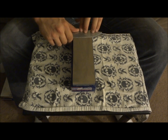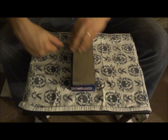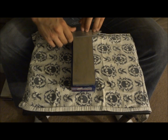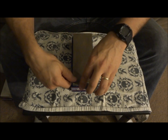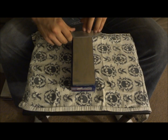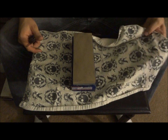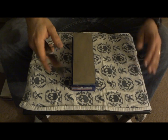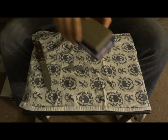That is really almost there. We're not going to spend too much more time on this grit — we're going to switch it up and go right to the fine stuff. Any little adjustments I have to make, I'll do with the DMTs later. But as far as reprofiling this edge, this is going to be about it. You can see all that gray right there — that is from this metal. Let me get some of the water out so it doesn't go on the carpet.